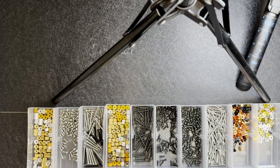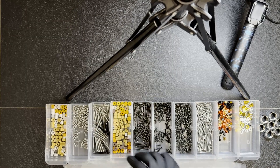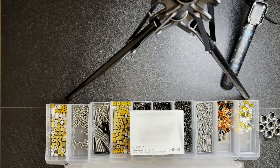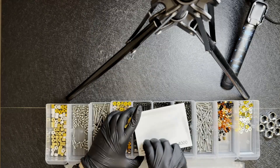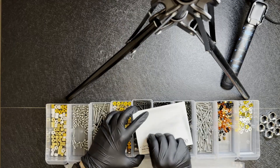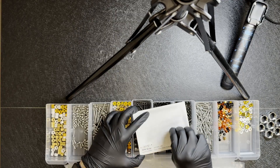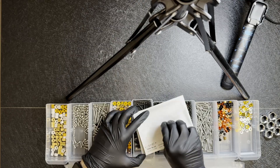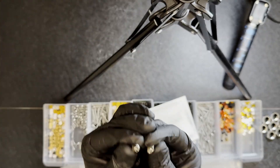Let's jump into the polish test, which is what I really wanted to show here. You can even do this at home. You'll need a 4000-grit polish pad — I get these in a two-pack from our local hobby shop, shoutout to Hobby Sense. I'll start with the 10.9 carbon, going back and forth for about 20 to 30 seconds, then circular motion for another 30 seconds. You'll see a very clean shine. Pro tip: you can drop a dab of oil on the 10.9 carbon to lock in a little oxidization protection — it looks really sharp.